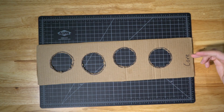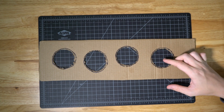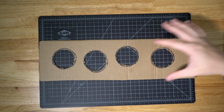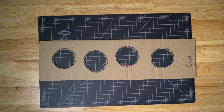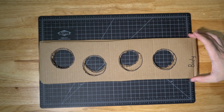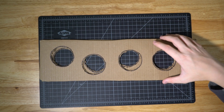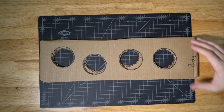Let's make a model of a pin and tumbler lock. I started by drilling four holes in a straight line in the core, but there's slight variance in their position — they're not all the same distance from the edge of the part, not all the same distance from one another, and if you look closely they're not all the same diameter or perfectly round. I drill four holes in the body and lay them on top of each other, and you can see the variance in each starts to compound — there are locations where they don't line up.